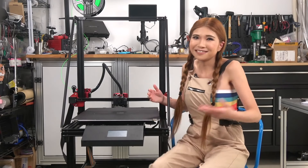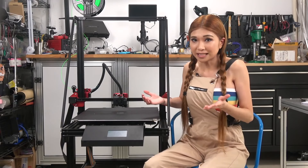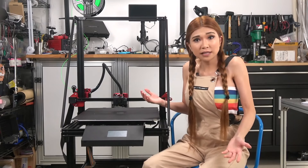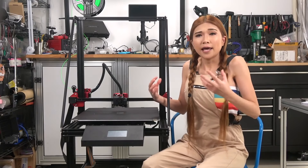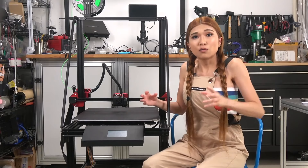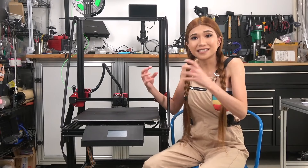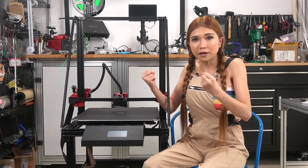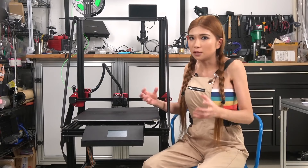I've also made a base for this since it's too big to really fit on any of my shelves. The first thing you need to know is I hate big 3D printers — I think they're stupid, at least outside of very specialized uses. A 3D print is a bit like wood in that it has layers or grain, and like wood it will split along that grain. So large 3D prints are often weak and can break easily. Usually it's better to make large objects out of many smaller prints fitted together — same as with wood, anything large and made in one piece is going to be much weaker.